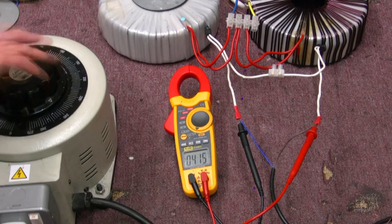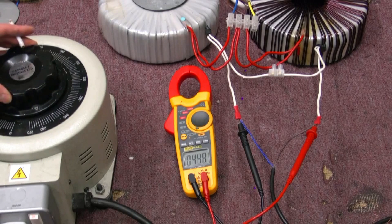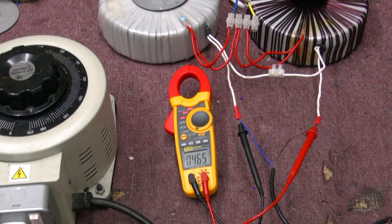With nothing complaining and nothing bubbling over - there's our standard 230V, variac halfway. I want 415... bang on. What about 440? Easy. That's not too bad, but I think we need to put some appliances on that 400 volt output and see how long they last with some amps.